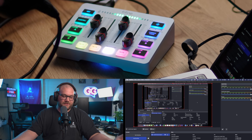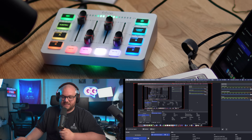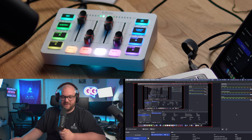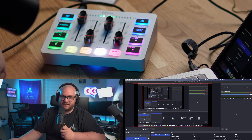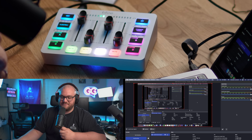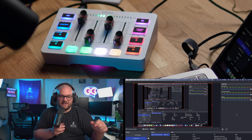Can it power an SM7B? It gets up to like negative 12, negative 13 at normal speaking volume. It doesn't tell you exactly how much gain it provides, but I'm guessing around 50-55 dB of gain because I'm maxed out here and this is me eating the microphone just to get to negative nine. So I don't think it's going to power the SM7B — not enough gain. If you have an SM7B, I'd make sure you have something like a Cloudlifter. That said, you're probably not shopping this $50 device for a $400 microphone, but for something like the K688 or the AM8, yeah, this really is impressive.